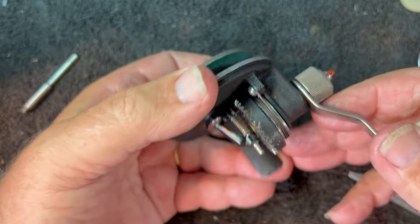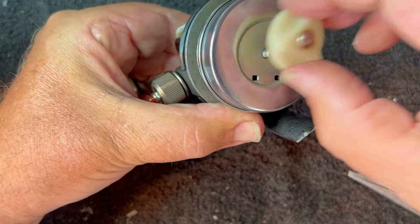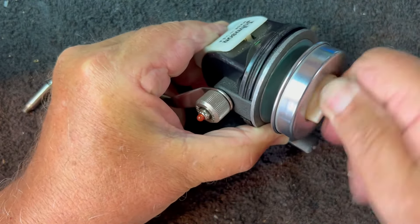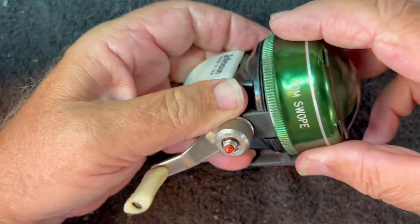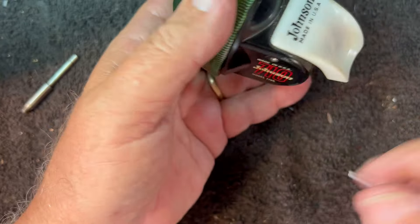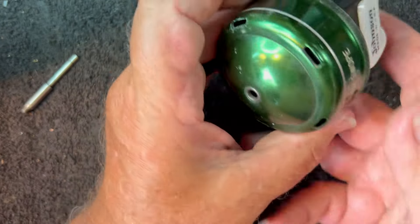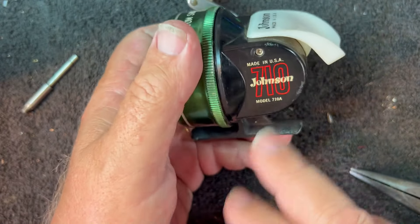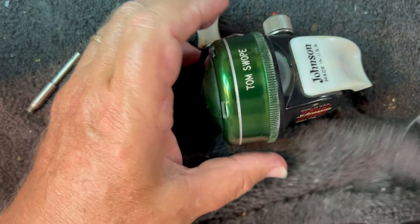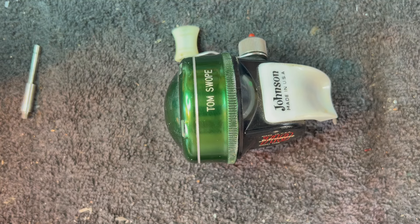That's the way it's supposed to be. We'll slide the cover back on here, set the rotor back in place, put the rotor nut back in place — the drag is slipping, okay — and then tighten it down. Now we have a 710, almost an A, but it's not because it doesn't have the same anti-reverse; it's still got the old 710 spring in it. I think it's really returned mostly to the way it would have been. I just need to eliminate that A off of there, and aside from that, it will be back to its original configuration. My thanks to Gary Barber for clarifying that and getting it straight. There's another successful reel, I believe. For now, that's Rich Stivers, this is Young Martin's Reels, signing out.